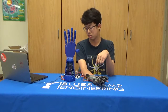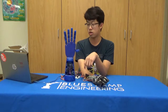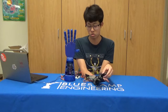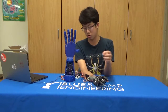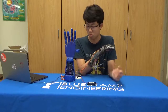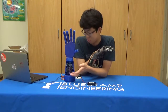And then when it sends the values over to the main computer, it relays that change over to the servos, and then the servos start to turn, and each of these sensors is connected to a servo through a code and through the wiring. And all of these are powered by a battery because the Arduino by itself is not powerful enough to power 4 motors. And there's not a fifth finger because there's no space for it inside of the wrist bay.